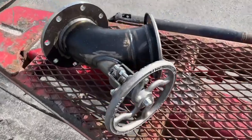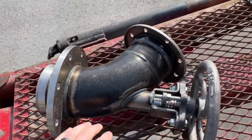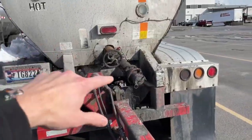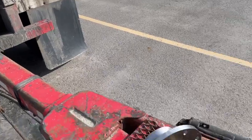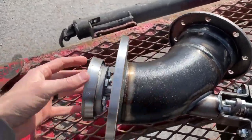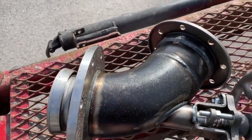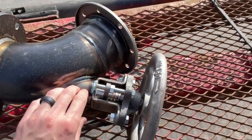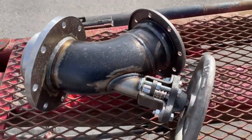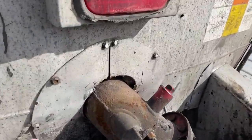This is a really simple valve — in fact there are no gaskets on here, which is really nice, meaning you don't have to be too careful when it comes to heating up the valve itself. Obviously if you've got flashing and wiring you have to be careful not to melt aluminum or wiring, but the valve plunger comes right against the valve so you can heat it right here and it transfers heat really well. It does have packing, so you can see that rod with the packing to prevent oil from coming through where the valve throw goes in.